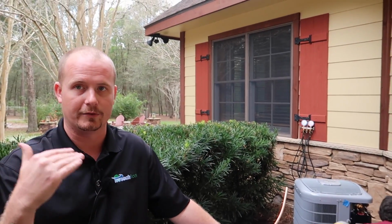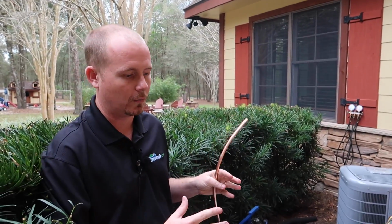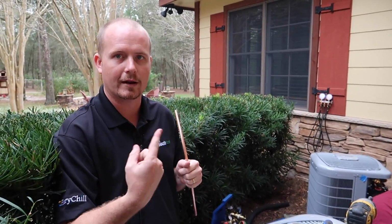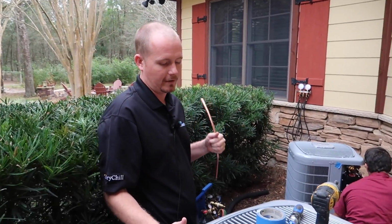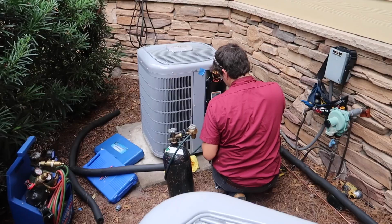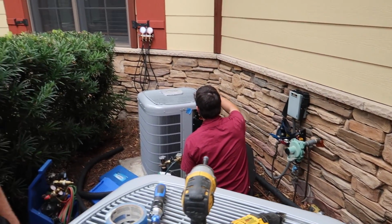Most like your old units, when they would start up, they draw up. You hear them, after they get older, they make a loud bang noise, and they dim your lights. So it's bad on the system when they do that. It dims your lights. It uses more power. Where these actually start slow. Even the compressor starts slow, and it slowly ramps up. That makes sense. Better for energy efficiency, better for longevity. And the reason I really like these units is that variable rotary compressors are proven technology.